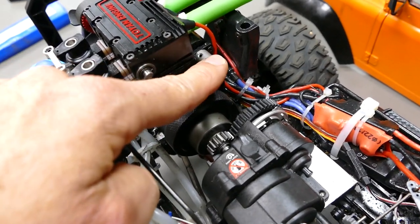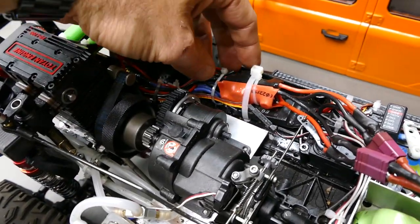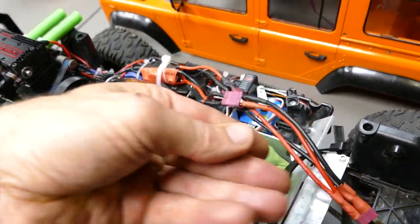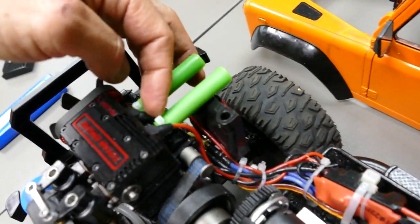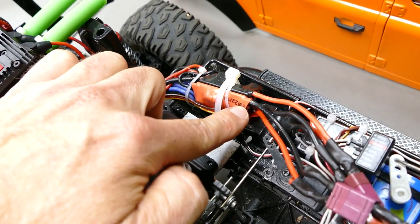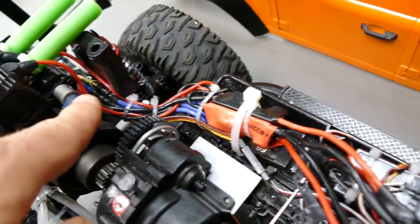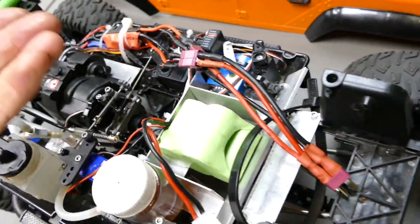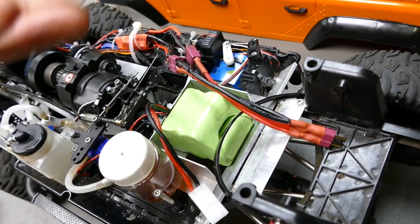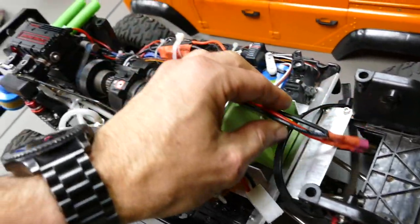To start this, there's a brushless little motor — a brushless starter motor on a belt — and that has its own ESC, which requires normally a 3-cell battery. There are also two glow plug igniters: one you see here is just for the glow plug, and the other is a combo of a glow plug igniter and ESC together. Once it's running you can disconnect this, though I just leave it plugged in. The run time is only about eight to ten minutes, so I don't see any real issues with that.